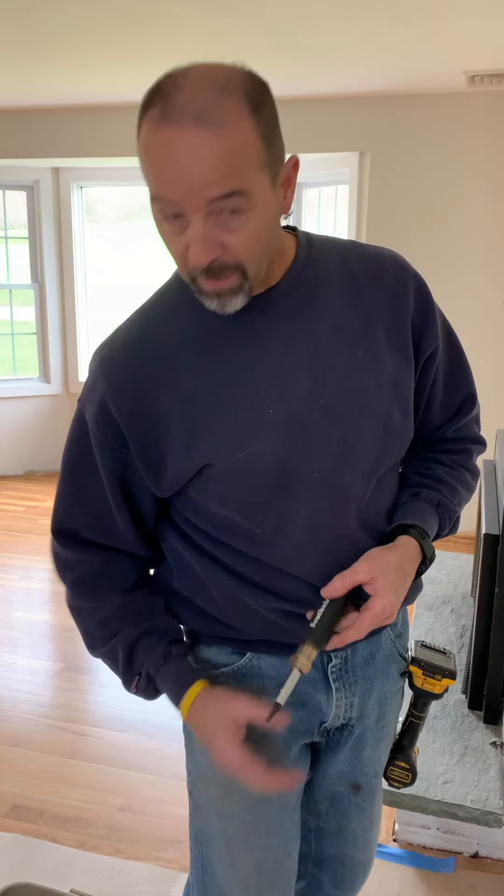All right, so just as simple as that — it's basically reassembly now. I get asked this question on and off: on the side of the outlet you have made your wires into a hook and they hook into the actual screw. On the back of outlets, even new ones, it comes with two different dots — those are to accept wires into those holes, and those wires typically will only accept a 14-gauge wire for a hookup. Some people ask do you like these hookups or not, because they're just a push-in type thing with a straight wire. I go either way — the convenience of pushing the wire in is a quick connection, where an actual screw-down connection and making a hook on the end of your wire makes a more secure connection. I think it's more of a personal preference, one versus the other. Thanks for watching — I'm going to put this back together and move on to the next.